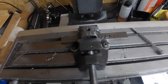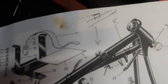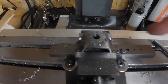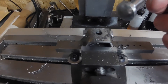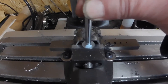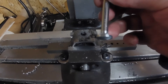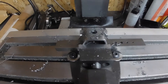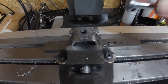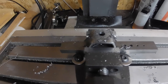Now I'm in the process of making this bracket for the tank bolt, which has got to look something like that in the end. I've just drilled the hole roughly where I want the slot to end. This is the bolt which has got a little square piece on it, so that will slot in like that and get its grip from that little piece once it's in. This bolt is 8.5mm square, so I've just got an 8.5mm hole there.